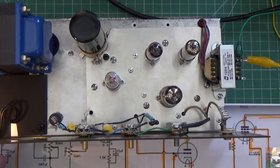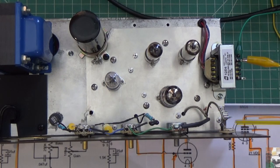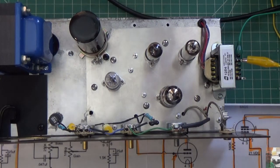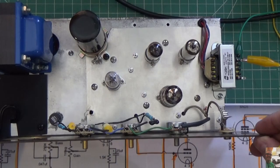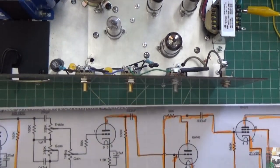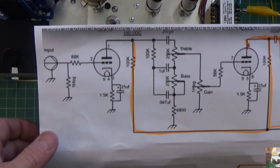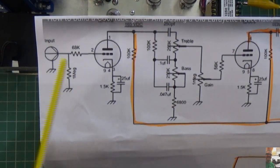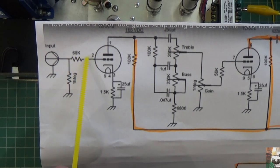Basically, what I have here is a big microphone running up on top of this chassis. So what do you think is going to happen when you turn the volume up? Feedback. Let me shut the amp down and explain what I think is the problem. First thing you see here is that I have this big wire running up through the chassis to the input jack. That in itself shouldn't be a problem. But I think I see what the problem is. Let me get the schematic. I'm going to show you the schematic. Here's the part we're looking at — here's the input jack.